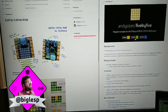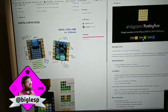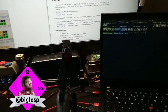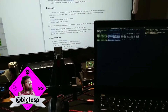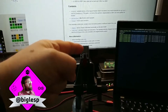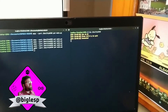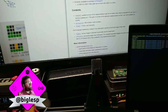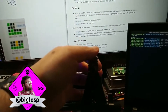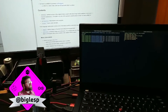So I thought, right, MicroPython — let's get that working. Someone's done all the work for me: Andy Piper, thank you very much, cracking job detailing the entire process. I've got it working. Right now a simple script turns it on, it connects to Wi-Fi, and if it shows three green flashes on the 5x5 NeoPixels then it's got a connection. It also prints something to the terminal. If it all goes wrong, I get three flashes of red. Reset button's around the back — let's reset.